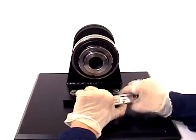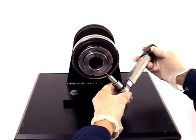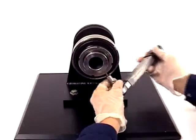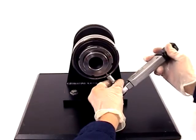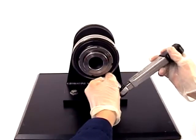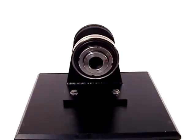The final step is to torque the locking screw on the nut to specification. Be sure to check the torque specifications before you tighten the locking screw. Over-tightening or under-tightening the locking screw could result in damage to either the shaft or bearing soon after the machine is put into operation. As a final check, turn the shaft or outer ring by hand.